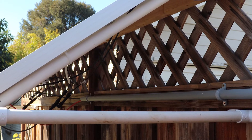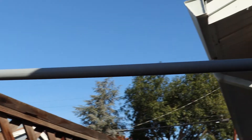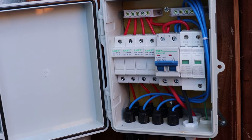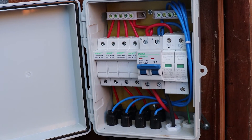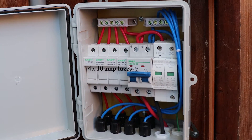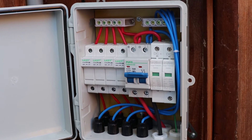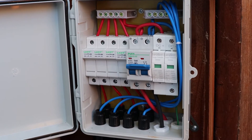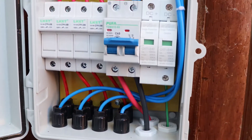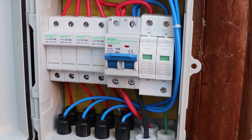The wires are connected and come down through this conduit and up over the top to the house and down here. The two wires — the negative and positive — from the panels come into this box. This is an Eco-Worthy connection box and it's got four fuses on the left hand side. They're 10 amp fuses, but I'm currently only connected to one set, so I have three more fuse slots to add other panels to.